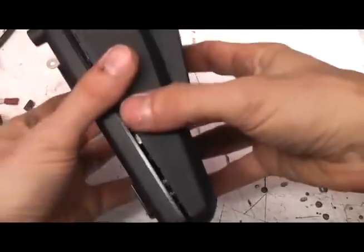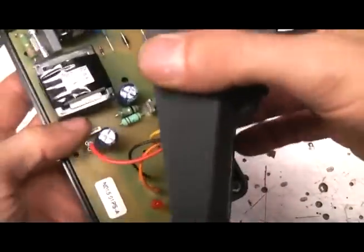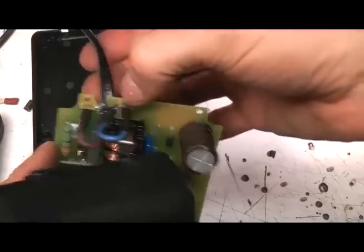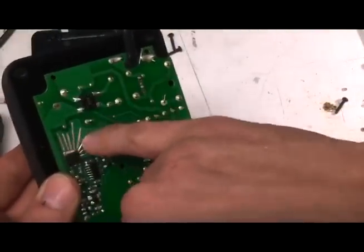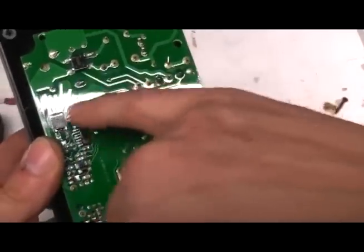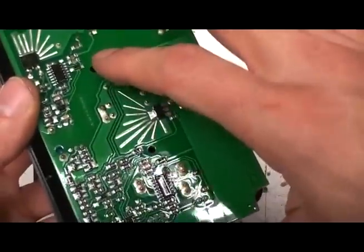Right, take a quick look at the charger, which I'm sure will show some nice construction quality. It's got all the leads plugging onto the PCB there. Sort of cord grip detail using the PCB. Decent sized fuse, mains input filter. Slightly unusual feature, I've never seen this before. I can only assume this is to improve thermal conduction slightly. It's clearly not for electrical conductivity. These lines aren't actually in the path of the conductor. And this board has got conformal coating on it, which is nice to reduce the impact of any moisture.